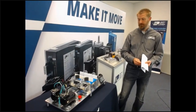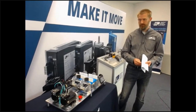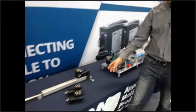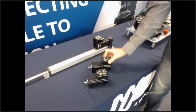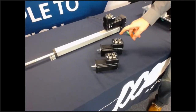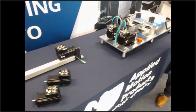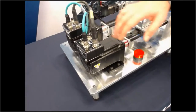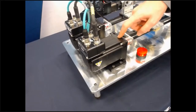Eric: What sizes of integrated motors are available with the TrueCount encoder? Mike: Good question. The first one we looked at here is a NEMA 24 — this is our TXM24 series, which has IP65 connectors. We also have a NEMA 23, the TSM23 series, which has standard RJ45 and pluggable connectors instead of M12s. And then on the larger motors — the 34-frame motor, the TXM34 — we have a few of these around for prototypes. If you have an application, talk to us. Generally speaking, these will be on the shelves and stocked in Q1.